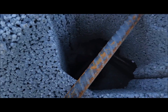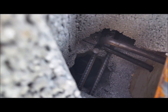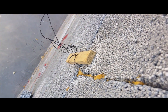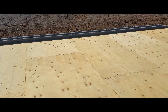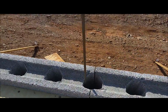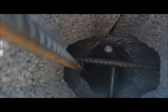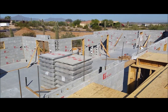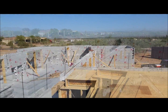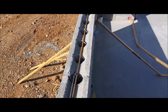When you look down in here you can see the anchor bolt tied to the rebar, and then we've got wire on the backside pulling it. You can see we've got this all decked and nailed off. Down in there at the bottom there's a pretty good view of the house. That block is going to go on the second deck here above the garage - looking good. We'll be grouting tomorrow.